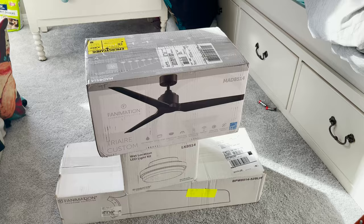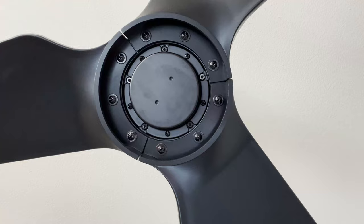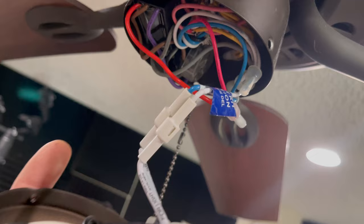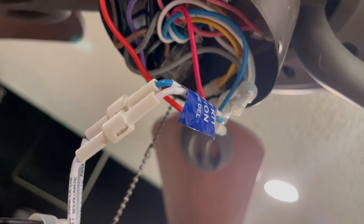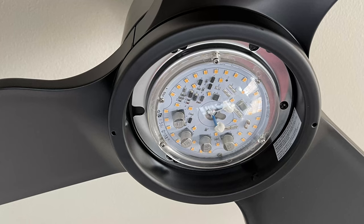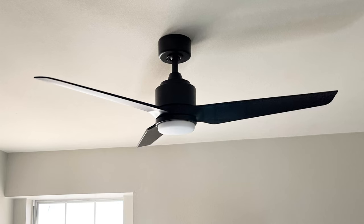These specific fans come with light kits as well — there's a third box with a light kit. Most fans are going to have a flat cover on the bottom like a hubcap. You take that off and there's usually a blue and a white wire on the inside for your light kit. Sometimes your light kit is going to have a black and a white, but you have a blue and a white sticking out of the fan — it doesn't matter, the black can go with the blue and the white goes with the white. Once we remove the cover, we hook up the light kit conductors, put the light in place, screw it in, and put the lens cover over it. Now we've got the entire fan fully assembled.